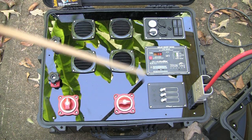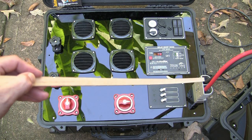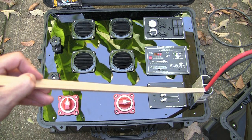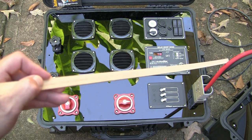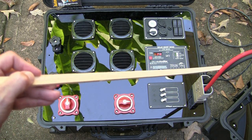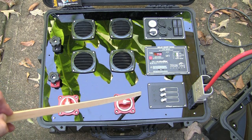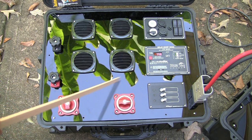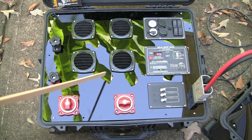The one key here is when you look over to this side, there are larger power cables coming out that go to my inverter. The reason is the inverter draws 200 amps, so you have to have the thicker electrical cable for it, and there is also a 200 amp quick blow fuse sitting underneath this panel as well. This acrylic was also bought on eBay in small lots. You can get it fairly cheaply.